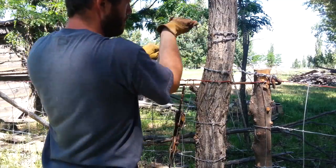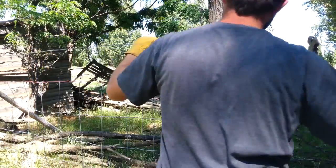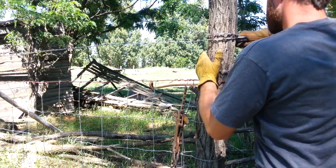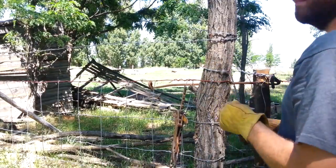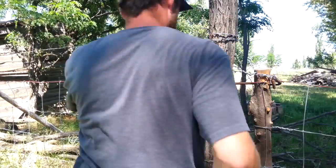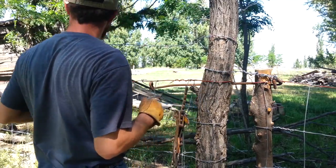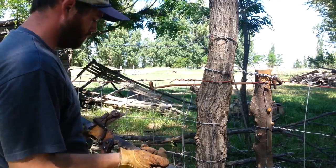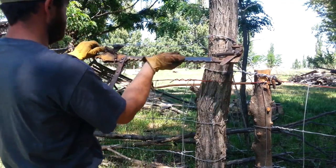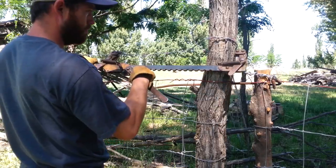I've decided to stretch the wire here at the gate post. I'm undoing it — I have to remove a staple here. I'll pull out my handy dandy pliers. I'll put a link in the description if you want to learn more about fencing pliers. Pull out the staple. Now I'm loosening the wire before I hook up the fence stretcher so the fence stretcher is not in the way. Make sure the fence stretcher is good and open before you get started, then connect the wire. Make sure you have a good solid connection and then you can hook it on the post.